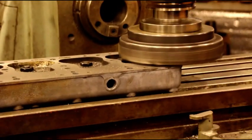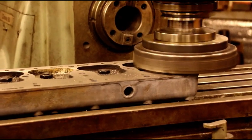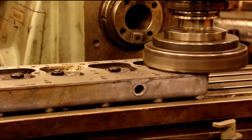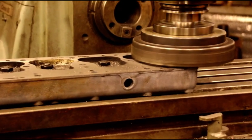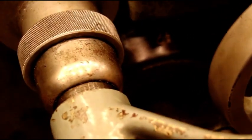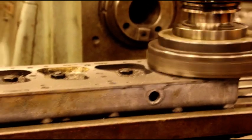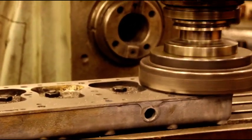We're on our finish pass. This particular head is cleaning up in two-thousandths. We took a one-thousandths pass and it cleaned up pretty flat — now we're slowing it way down at two and three-eighths. That's giving us a real nice finish. We'll just set one up after the other and work our way through all four.